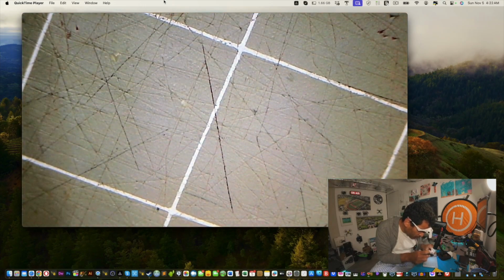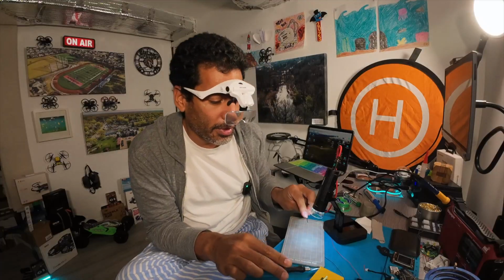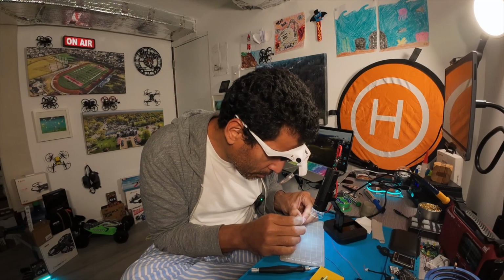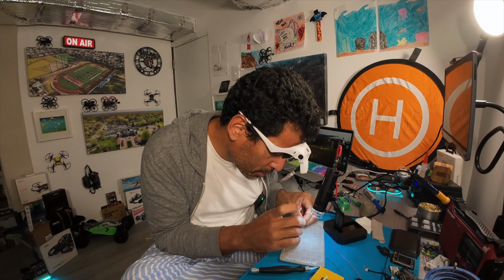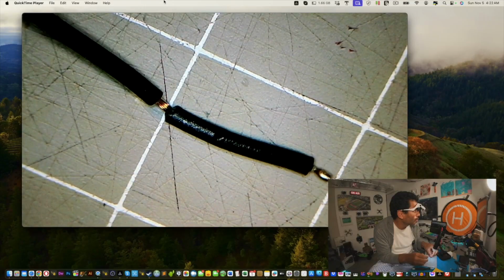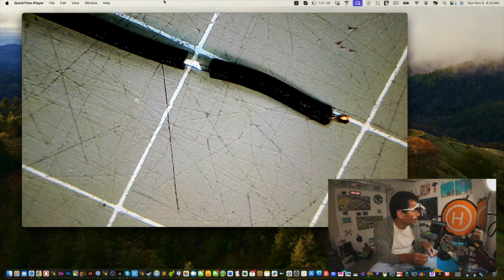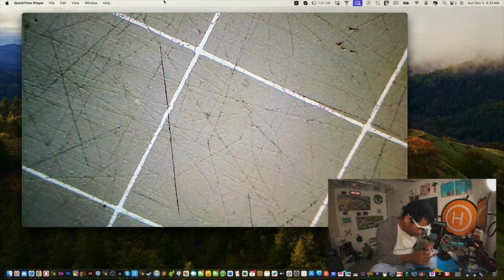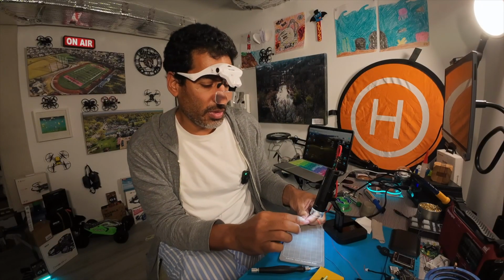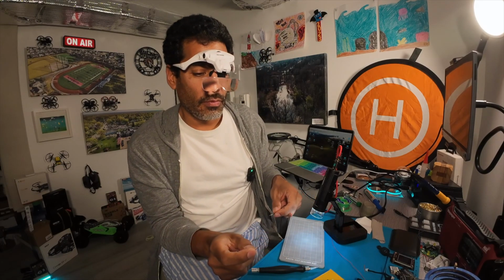Nope. It still hasn't broken the wire. Oh yeah, it did, I think to some extent. Yep. I have to get wire cutters. Nice. And so this one, hopefully, I think. Yep. See that? Make sure. No, it doesn't look like it. And I didn't break through anything, which is great. I mean, if you do, it's fine if you break one or two, but you just want to make sure you cut just deep enough for the wires.